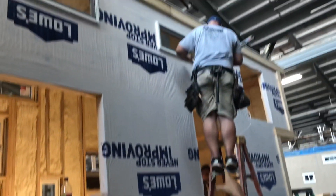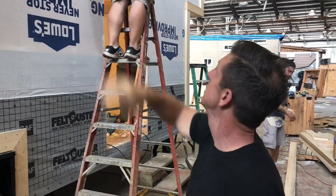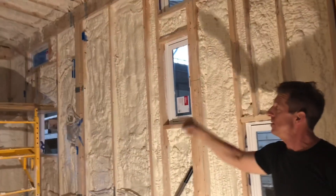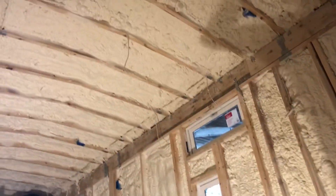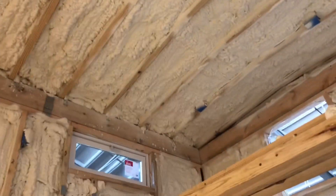You can see the windows Mike's putting in. They'll be taped with window tape and caulk. All of our rafters are cut out of one piece of wood, out of a two-by-eight. We put a four-degree pitch on it to give us a three-inch slope. That's on all this — not much waste, and they're ready to go.